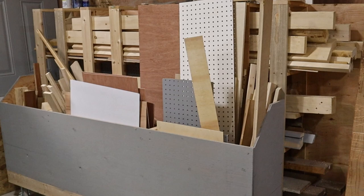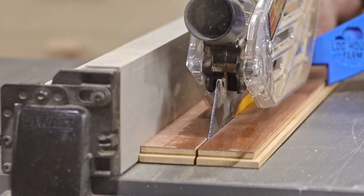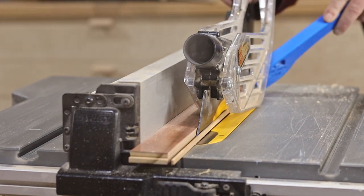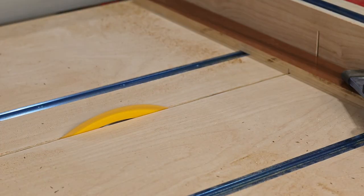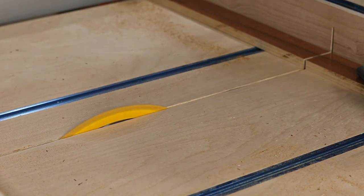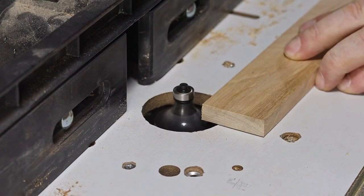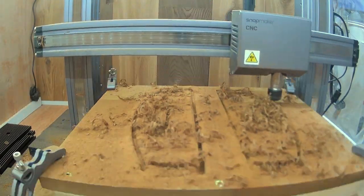For the side pieces, I'm going to use some other scraps from the bin. These are some flooring scraps that have been around more than 10 years. I think this is the last of it, so I'm going to use it all up for this project. After cutting my two strips on the table saw, I ran them through the planer off-camera to get them to the same width as the rest of the boards, and then I cut them both to length with the cross-cut sled. For these two sides, I'll need a round-over that matches the curve on the two end-pieces, so I swapped the router bit out for a round-over bit and ran the two sides through the router. By this time, the end-pieces were all done.